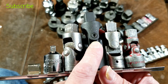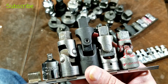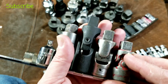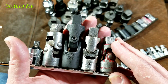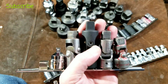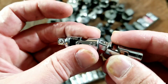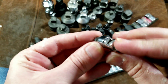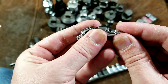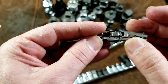This photo also shows the dramatic differences in heights from various designs. For some reason, these Harbor Freight ones are just really long — I don't know if they make them longer to take advantage of some torsion, but they're incredibly long, and that's actually why I got them. Having different lengths allows you to more easily reach the fastener in an optimum fashion. Sometimes if these are too short you're not quite able to reach fully; if they're too long, they're bending at too steep an angle and are difficult to use. It's nice to have different lengths. You can put two standard universals together, but they really start getting out of control — the only way to get away with it is if you can hold the center section with your fingers, or brace it against something, otherwise it'll just bind up and break.